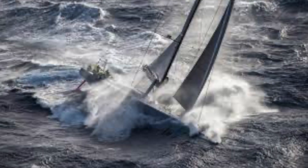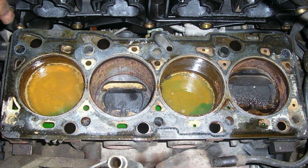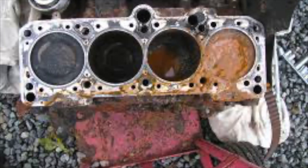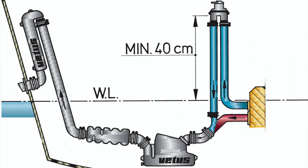What is this hydrolock? An offshore passage in rough conditions with large waves rushing past the boat — such as sailing on a beam reach — sets up hydrostatic pressure that causes water to siphon into the engine. Water siphons back into the engine exhaust hose, fills it, and flows into the engine via the open exhaust valve. The anti-siphon loop we are installing blocks the water siphon, thus preventing hydrolock.